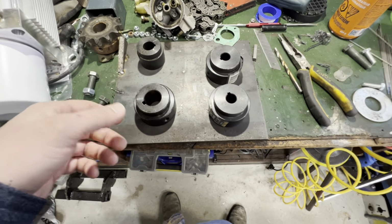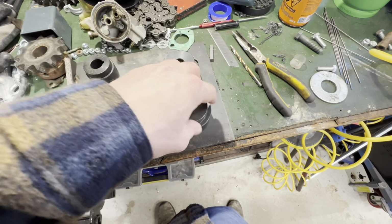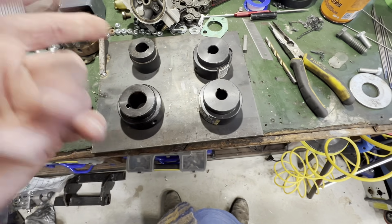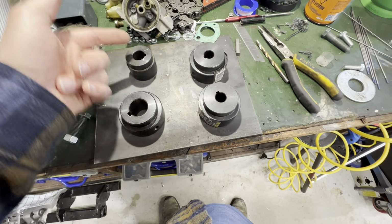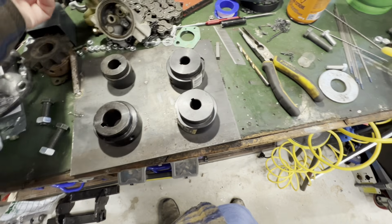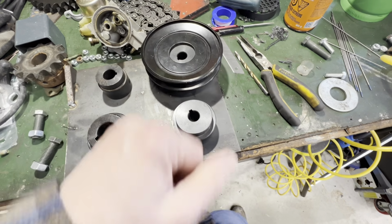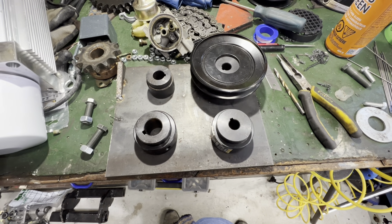So the next step here is to machine some of these hubs down. These are X type of hubs. They have the larger diameter for mounting a sprocket to them. I actually need a W series, which is what we have here. The reason that I have the X is really because there was no stock on the W series with the inside bore that I need. These are going to be used for our pulleys. These will go onto the engine and the 2 pumps. So this is part of the whole driveline setup. What we need to do is just put these into the lathe, no big deal. Turn them down so that these hubs will fit onto them, and then we can continue getting the rest of the engine and pump mount plates mocked up.